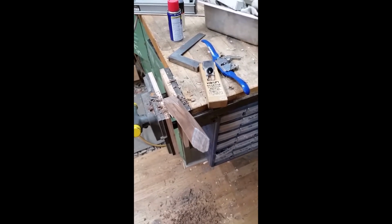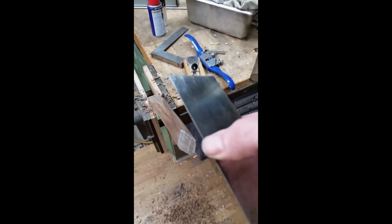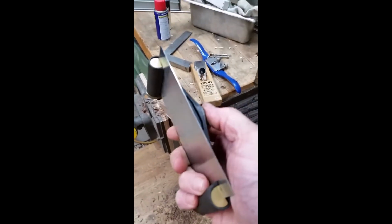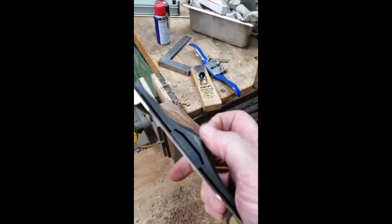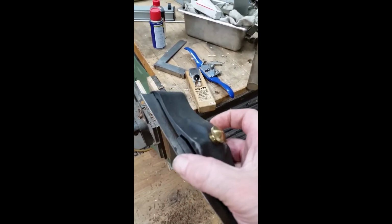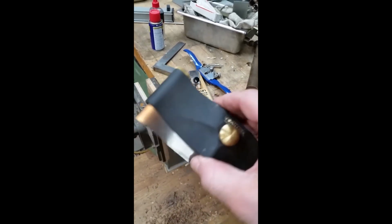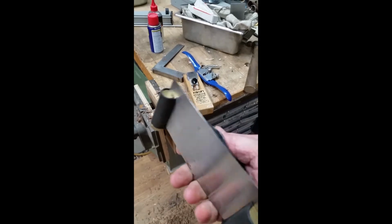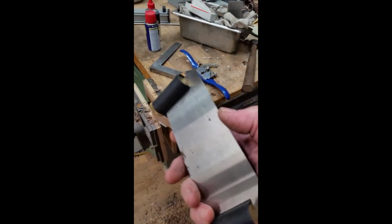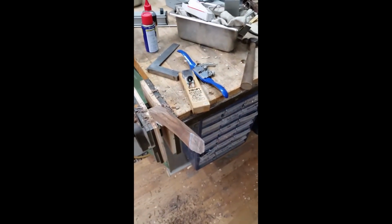They will wear on your fingers a little bit because you have to keep them curved like so for them to cut nicely, which is why holders like this were invented, right? So you can turn this screw and it puts that little bias on there, right? And you can push these or pull these. You can sharpen or put a hook edge on any one of these edges too. So pretty versatile tool. So let's go and make some more adjustments to the edge here.